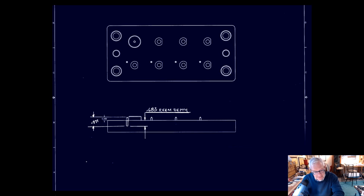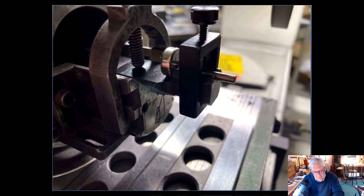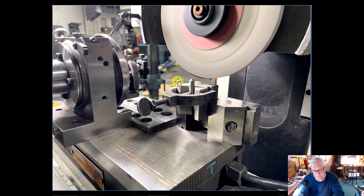I've got to grind these things and I want to hang on to them. I'm using a little super vee block that fits into my surface grinder whirly jig. I'm using an 80-grit wheel — when you're working on small parts, you get around things like intricate grinds by upgrading the grit number. Instead of a 46-grit or 60-grit, I went to 80. I thought 100 would be too fine and would probably burn the parts — 80 was the right choice.